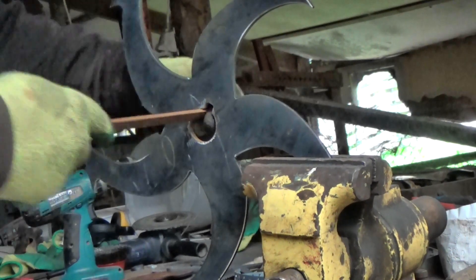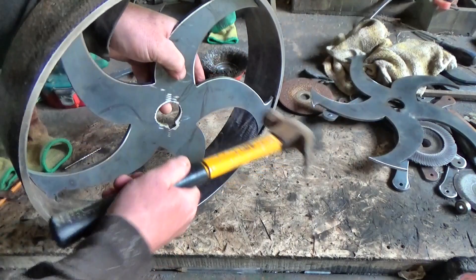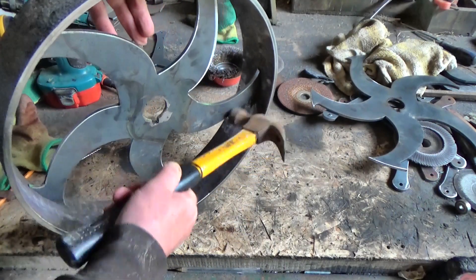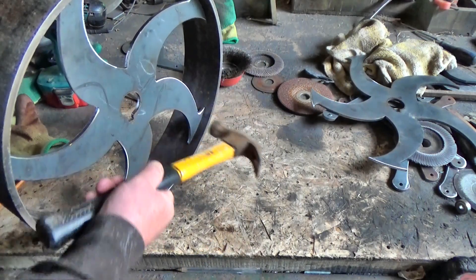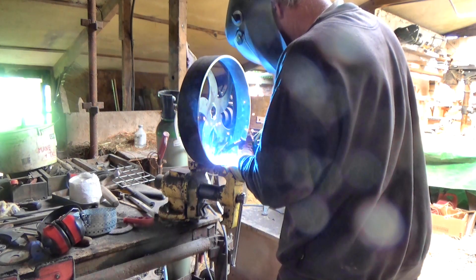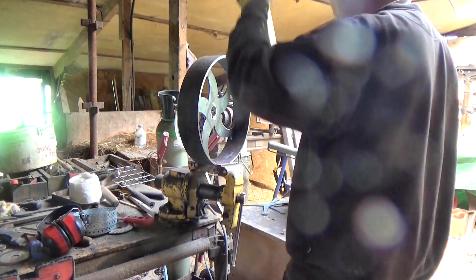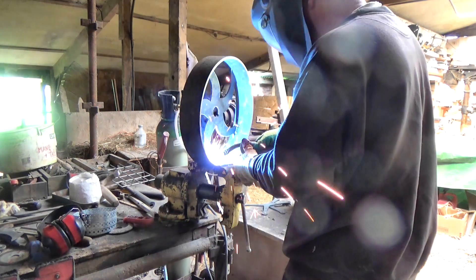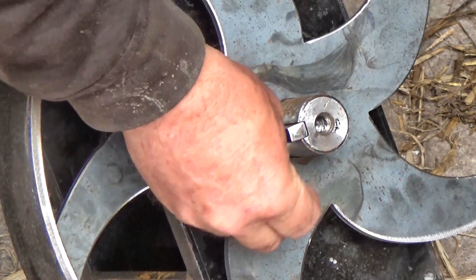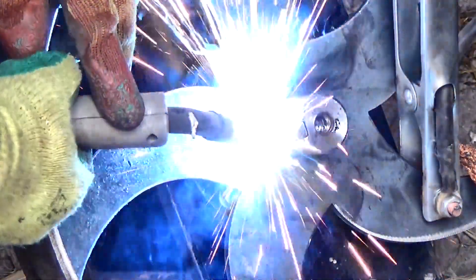A little filing was all that was needed to give me the right fit on the shaft, and hitting it with a hammer to seat it in the right place in the rim. I just tacked it in place with the welder — Will's the real welder, so I'll let him do a tidy job later. Normally the key is left unattached, but welding it to the discs means I don't have to have a stack of spacers between them. The pulley will still slide on and off, of course.